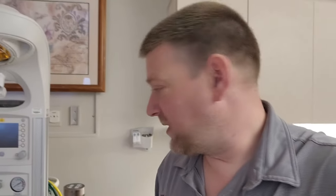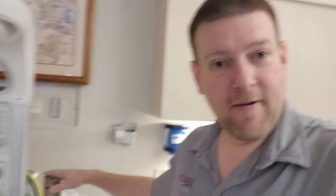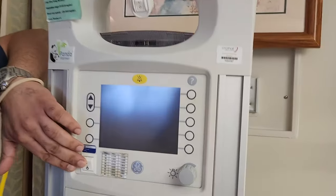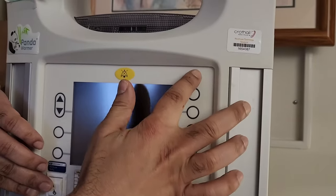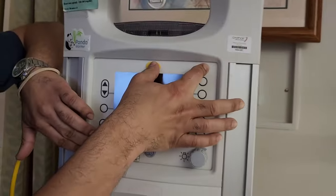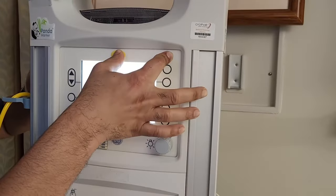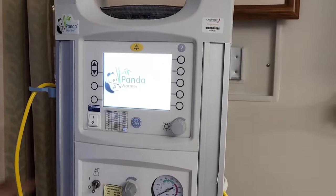However, you do need to perform calibrations periodically. We're going to show you how to do a calibration using a five kilogram weight — that's 5,000 grams. To enter calibration mode, press the question mark and the alarms button, flick it on, wait for the two beeps, then let go.